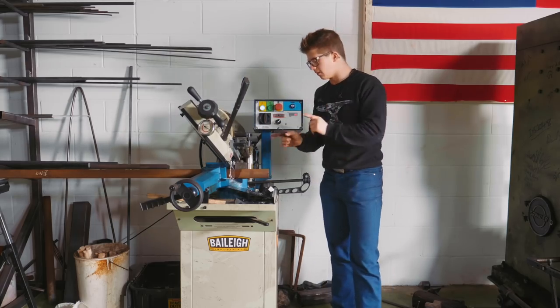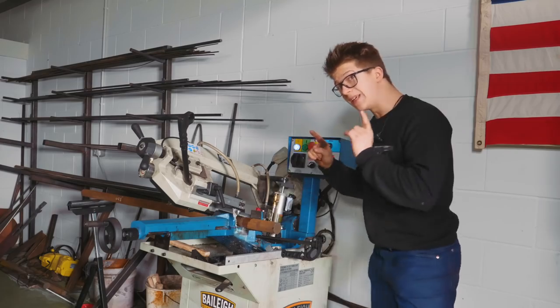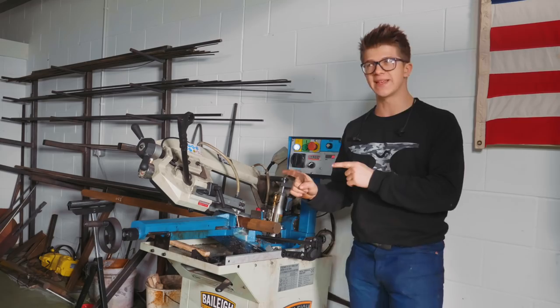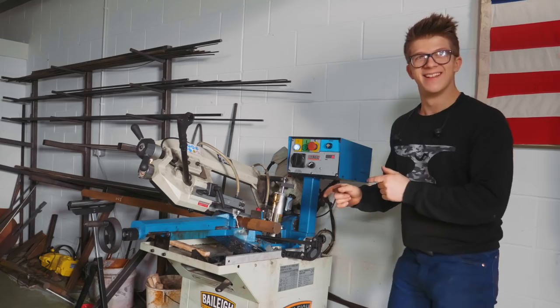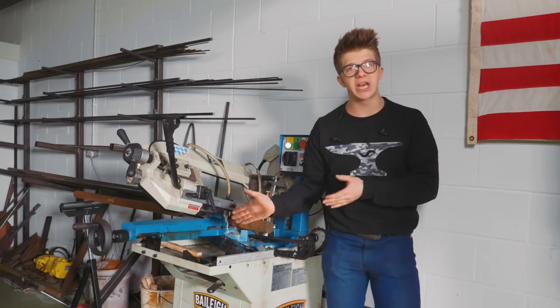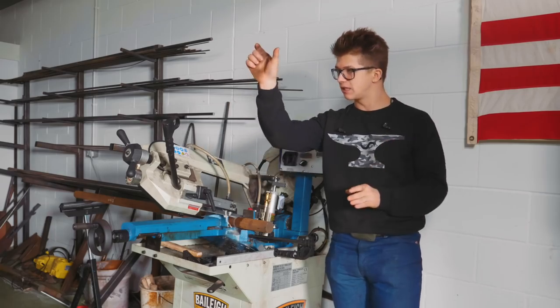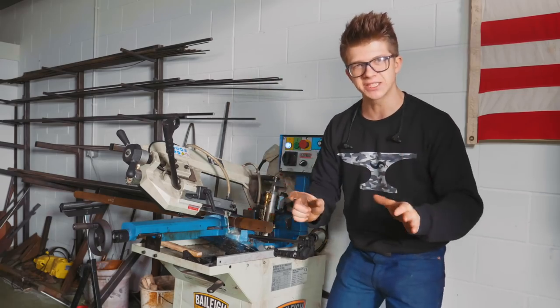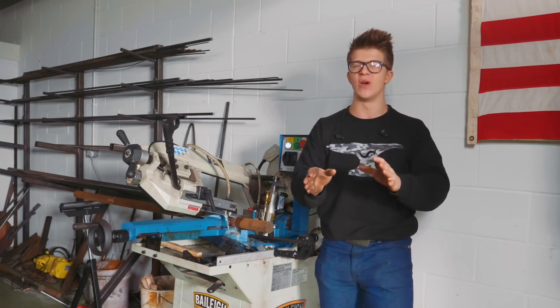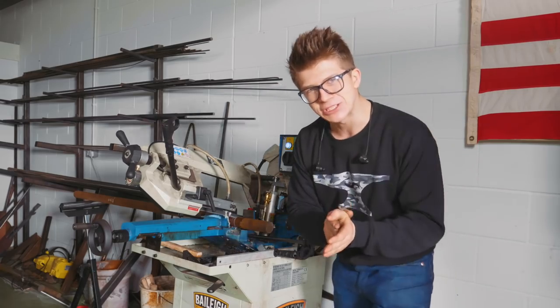We are going to take mono steel, you know, a single piece of alloy steel. In this case, we got a piece of 1055. Almost said sword. Scared the crap out of me, Jamie. How you doing? So what we're gonna do is cut off the 1055, draw it out into a long bar, and that bar is gonna go either side of the Damascus steel, adding a lot of heft to it, and hopefully making a very, very different and special Damascus steel design.